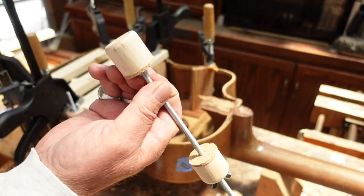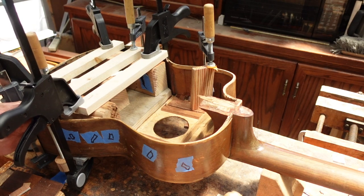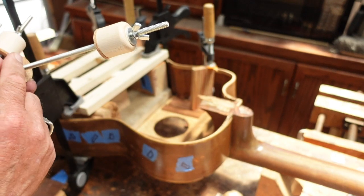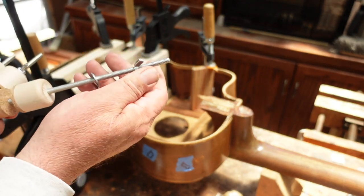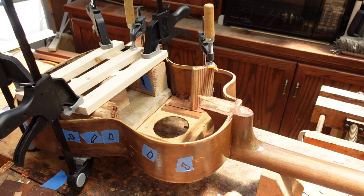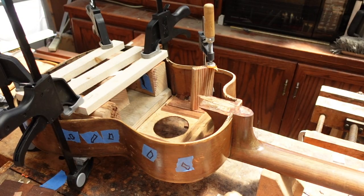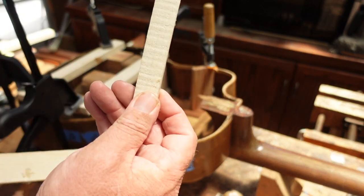These handy, nicely made spool clamps can be pretty pricey, but they're pretty simple: a piece of all-thread screwed into some cork material, a washer, and a wing nut — and you're good to go. We also had two of our usual clamps here, and you'll remember that we used a wedged piece of wood that gives you the final tightening you need. Always have one of these around.